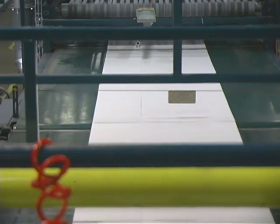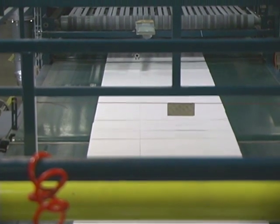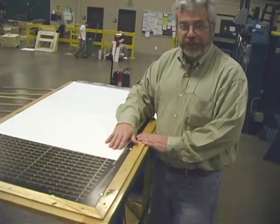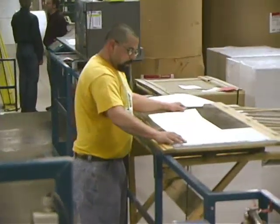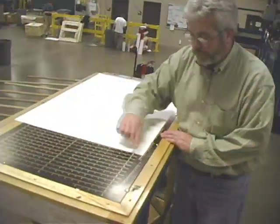Top of the Marquip dual rotary sheeter, 72 inches wide, and when this baby cranks up, it can run 1,000 feet per minute. We're running the sheeter much slower now so that you can see the sheets actually coming off the bed of this large sheeting machine. As the sheets are coming off of the machine, the attendant will take it and put it on what's known as a square table to check for perfect squareness.